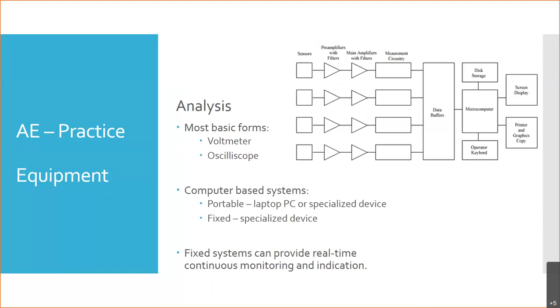Okay, so that's giving you kind of an average. Why do you say analog? Because you can see it bounce around. So actually, it's both. If you're trying to look at whether the signal is getting bigger and getting smaller, an analog meter works really well, because you can see that needle deflecting a little bit, then more and more, and then less and less. If you actually need to measure it, you're probably going to be able to measure it better, or get a total energy, using a digital meter. So they're both good, it just depends on what your goal is.